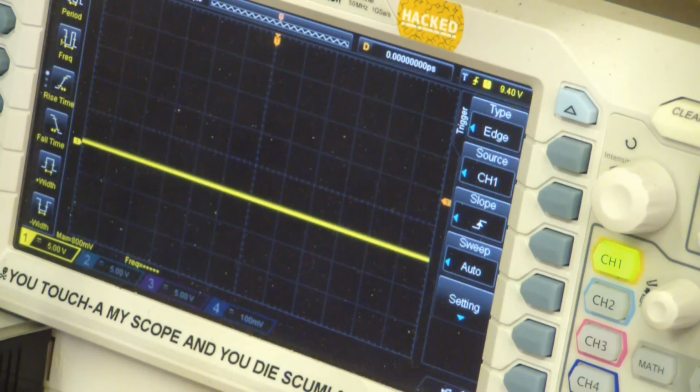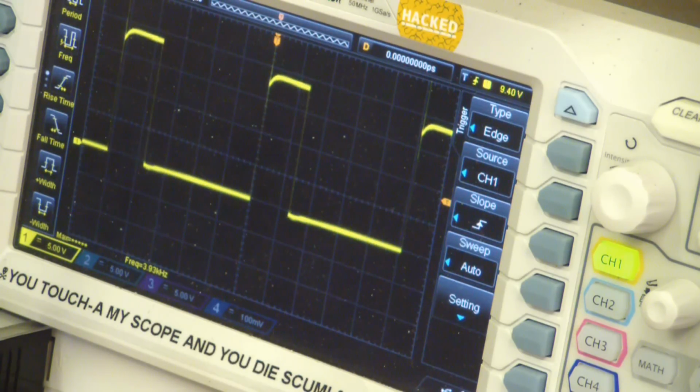Okay, here we got the scope set up, and you see the frequency is 4 kilohertz. That's why we hear it plain as day. They could easily turn that up to, say, 20 kilohertz, and then we wouldn't be able to hear it at all. It'd just drive all the teenagers away, because us old folks don't hear that high in the register. And the top of the mark there is at 20 volts, but the average is maybe 3 volts.